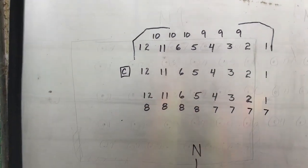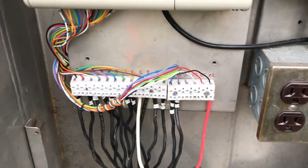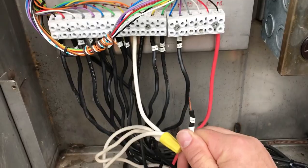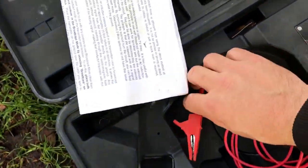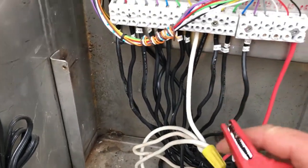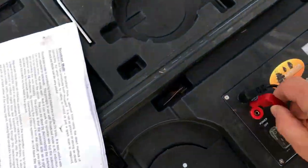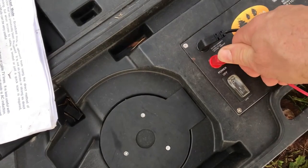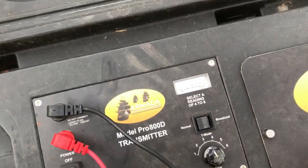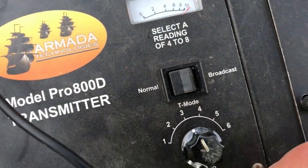Number 11 is the one I need to figure out. These are our Rainbird small screwdriver terminals here, and I've already loosened it up. I'll take that out, attach my clip to it, and the loose end is going to go into our box here. That's all set — we're going to turn it on. Take a look at our reading: it's bouncing off the top, it's too high. I need to turn this down.